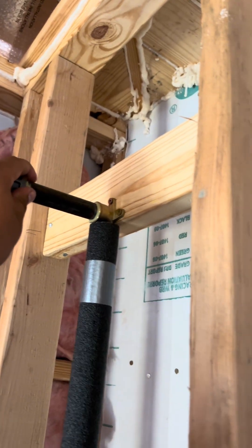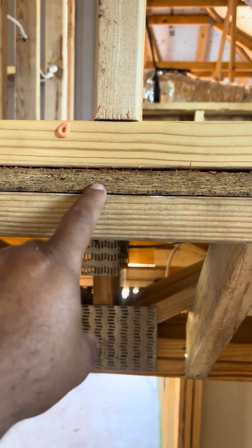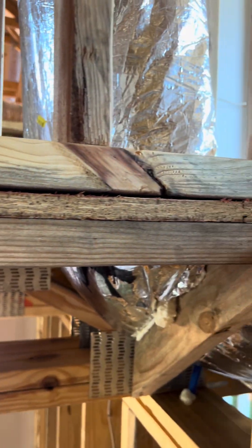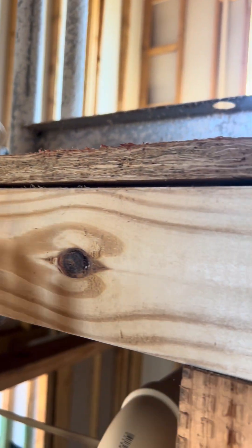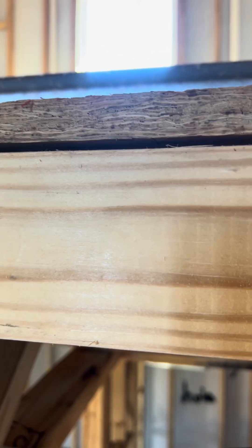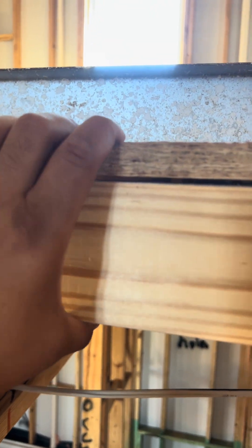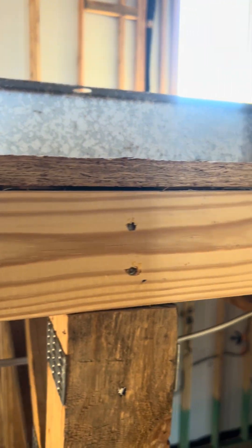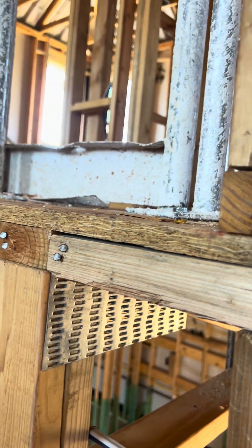This is going to be loose. Missing foam. So this is your subfloor right here — look at that, it's real nice and tight, and it comes around to a little bit of a gap. You get a pretty decent-sized gap here where it's going to bow in. Put my finger on the back side so you can see my finger popping up. It's a pretty decent-sized gap here — you can see the movement, you can see the gap. It's going to allow for deflection.